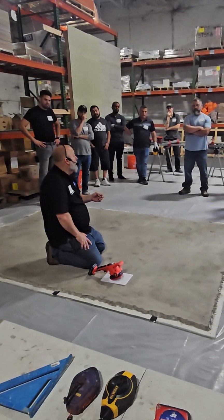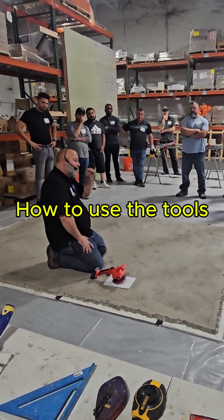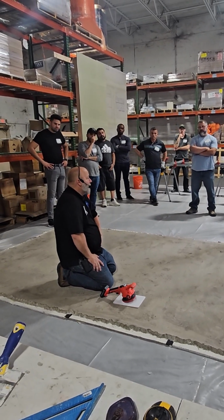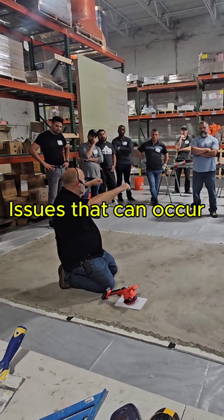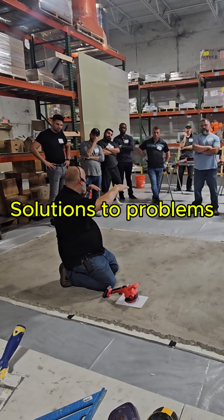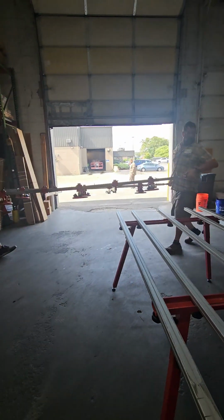The next day, some of them will even say, hey, you can come in with one of those multi-tools and cut you out of spot, put some fresh water in there, and slide you one in the next day. Here's what I want you to know, though. Whenever you finish up at the end of the day, you have to vibrate in that edge. Make sure to put a straight edge on it. That 10-foot straight edge, put that on there. Because these things have a lot of flex on them, and you do not want to deal with a hump or a dip the next day. It's going to be impossible to fix.